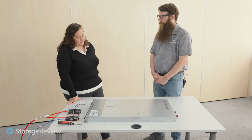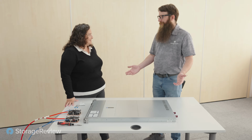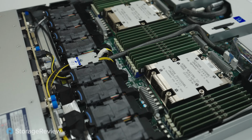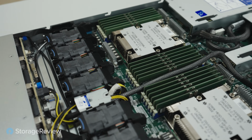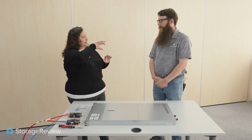Exactly. So in terms of limits, currently there are pretty much no limits. It's practically none at this point in time. And most of the CPUs and GPUs today have more than one die underneath the chip, so it's multi-chip packaging. For example, these Bergamos have a lot of chiplets around them. You have the I/O in the middle, and then a few CPUs on the sides. Each one of them has different heat fluxes.